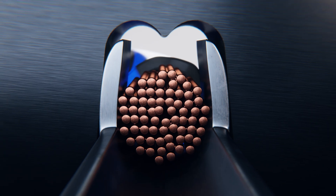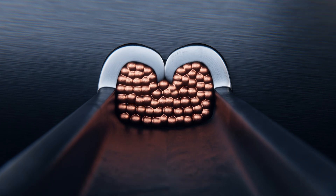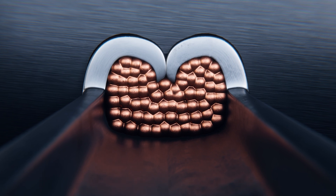A good crimp, as you can see, compresses the wire about 20% and properly forms the terminal to the wire. This delivers the right mechanical and optimal electrical conductivity. No need to guess with our tool — let the tool do the work.